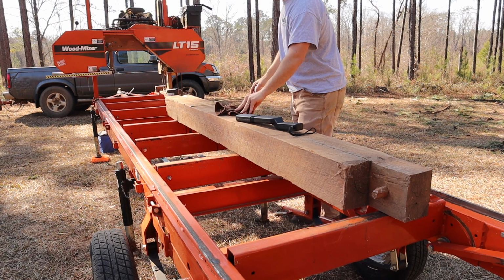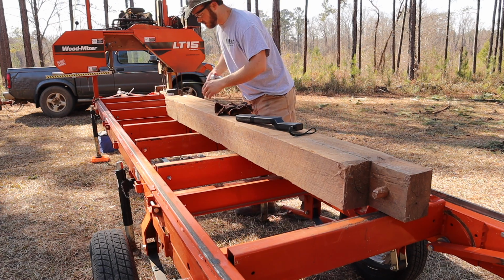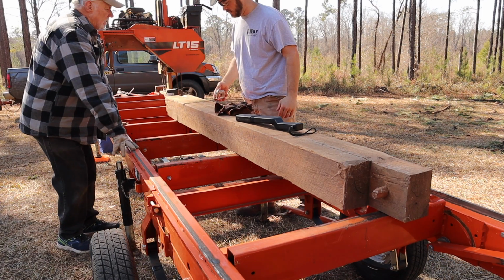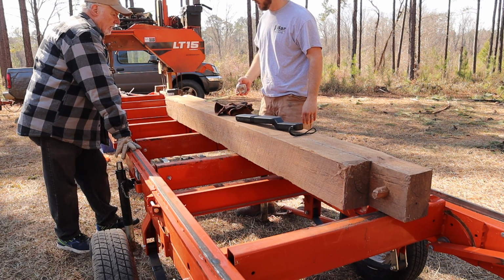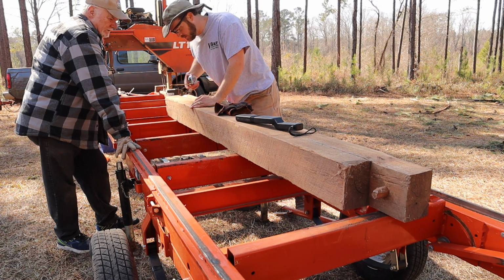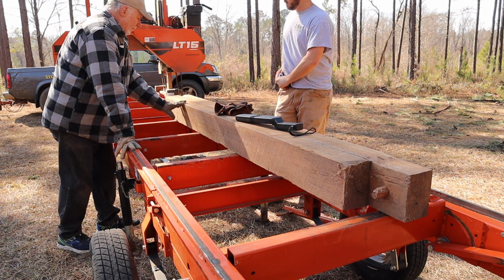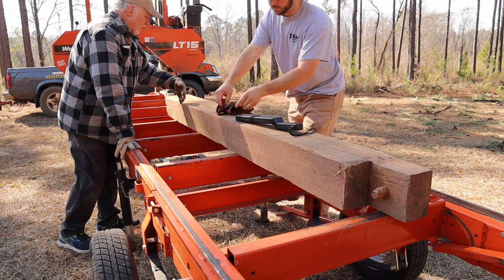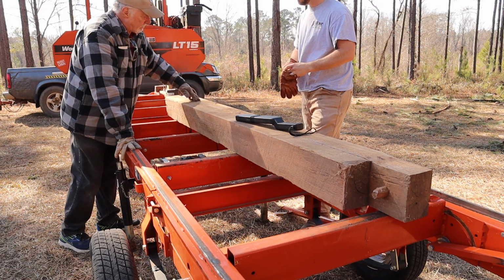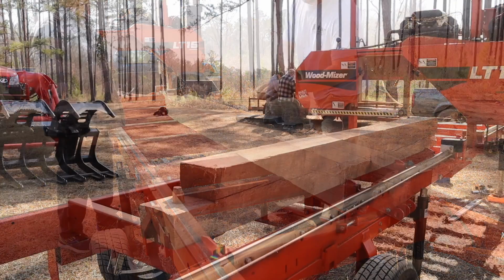Do you want these sawed so that we cut wide boards, or do you want these narrow ones from the top like this? So you'd get an 8-inch board there, but I'm worried about that split. A 6-inch board there, but it looks a little more solid. Well, yeah, you're right. I'd rather cut it like this. And when you get down to that, you can cut a piece out of this and just throw that away, since it's all busted up. Okay.